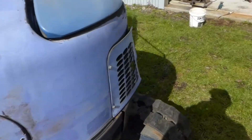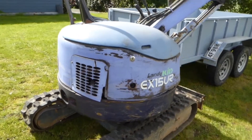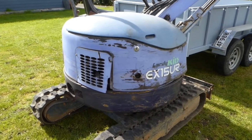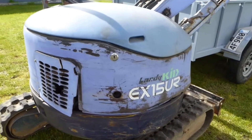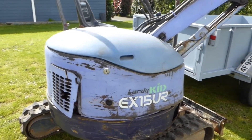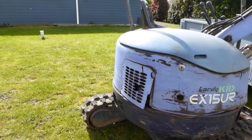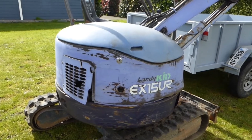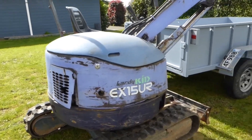I also had to do a bit of work on the old digger this morning because it wasn't running — it was only running for about ten seconds and then it shut down. I have a diesel bug in the tank. I've changed the filter and put some de-bugging stuff into it, but I think what's happening is the gauze in the pickup in the tank is covered in crap. So I have to pull that pickup out, clean the tank out properly, and replace another filter.